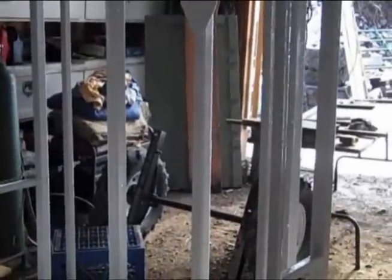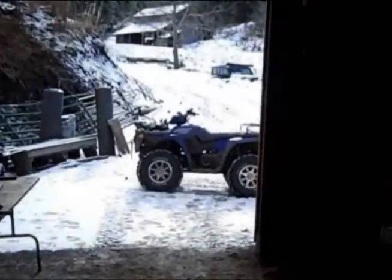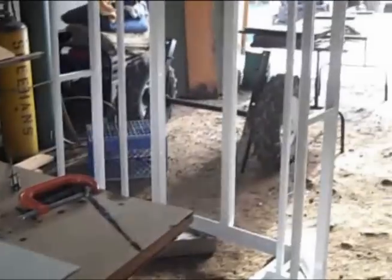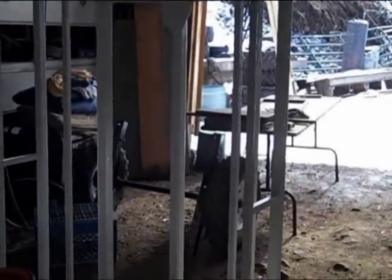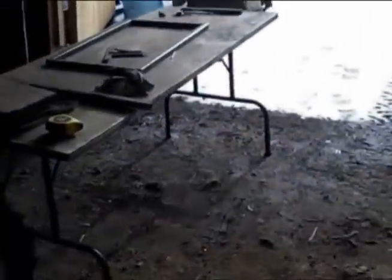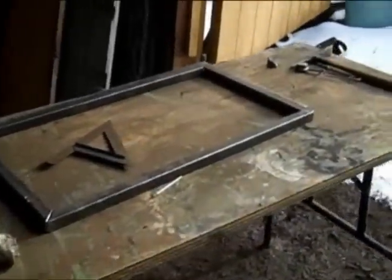The floor is over there in the corner — just a piece of wood, piece of junk, but it'll work. As soon as this dries — probably tomorrow, since it's cold and won't dry fast — I'll rivet all of this metal onto that frame. This metal is already pre-primed so I don't have to prime it; then I'll shoot the finish coat with a spray gun and the trailer will be done. In my spare time I've been working on this little rear door.